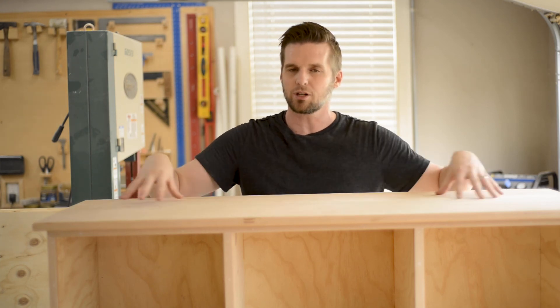I finished building the bench — now it's time to think about the finish. The client I'm building this for wants a natural cherry top and a painted base cabinet. So I'll spray the top with several coats of oil-based polyurethane, then start on the bottom by spraying primer to keep the wood tannins from showing through, and then it's getting painted black with a water-based polyurethane on top of that.